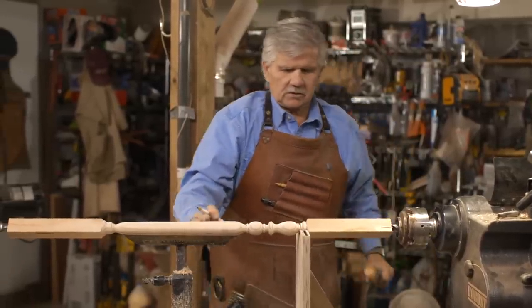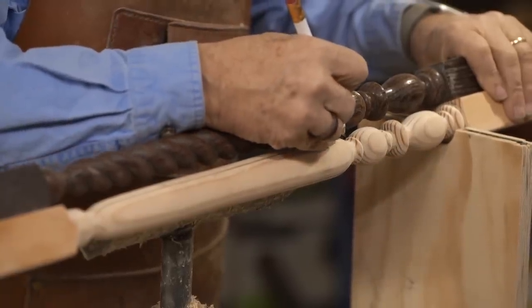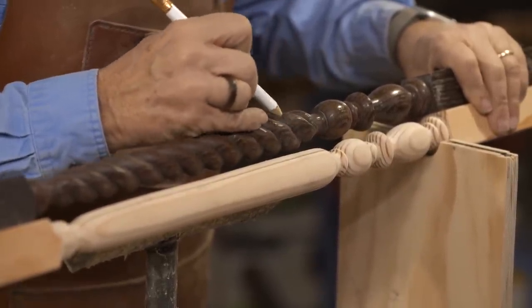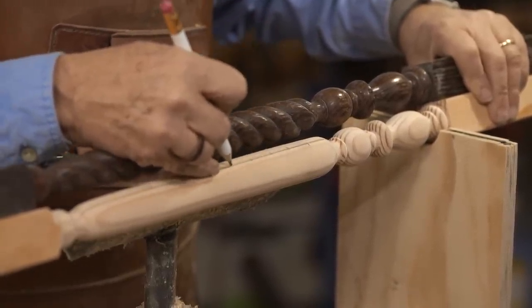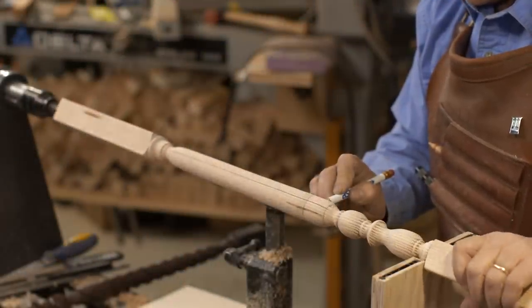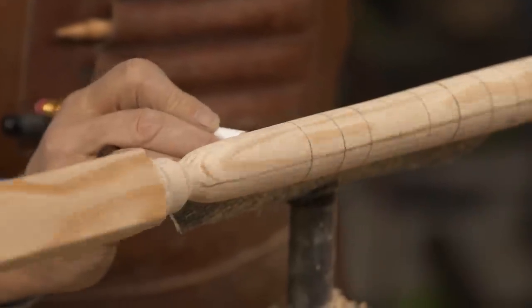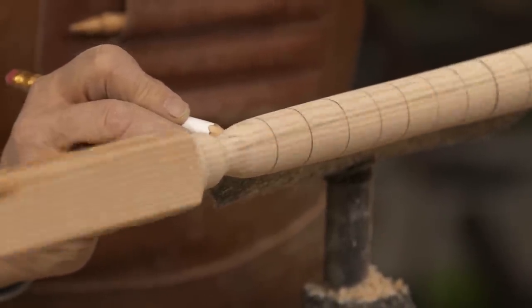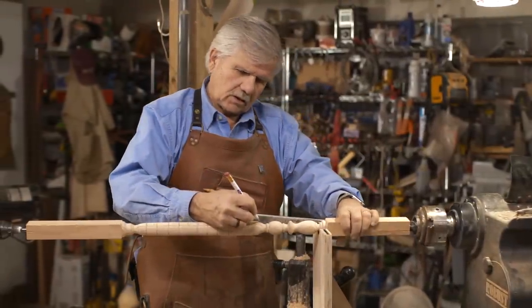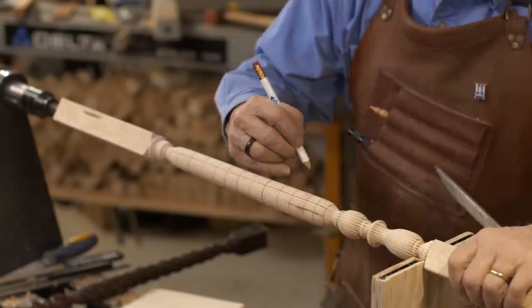I want to match the rope detail on the original spindle. I'll take the spindle and make a location point, looking at the V's on each one, and line that one up on the line. I'm going to spin this around so all my locations line up with my marks. Then I need to get a line from this center point up to the next one, to the next one. The easiest way to do that is with a string line.